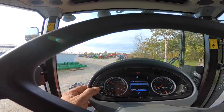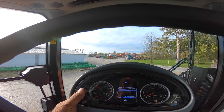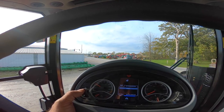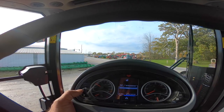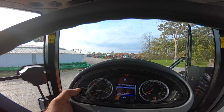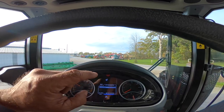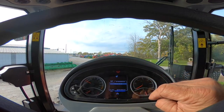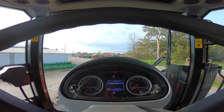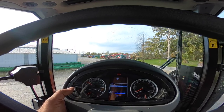Here is our DPF regeneration screen. You really should not have to mess with this — the tractor does its own exhaust regeneration automatically. You do not want to inhibit this, which turns the system off, unless you were working in a building. If you ever needed a manual regeneration, an exhaust light would come on and flash — that is very rare. If it did, you'd go in here, hit OK, and it says 'forced regen.' That is a parked or stationary regen.